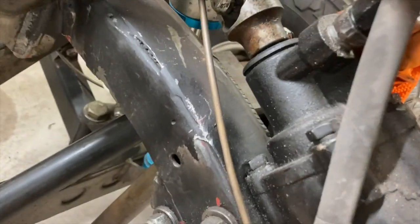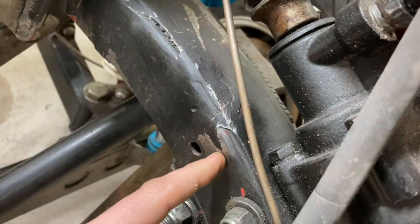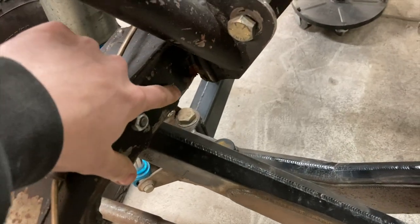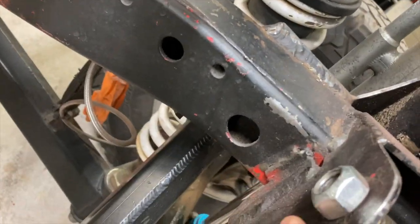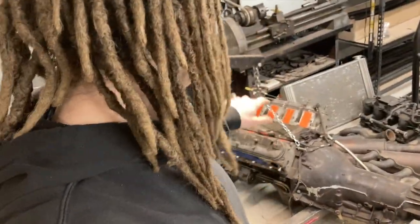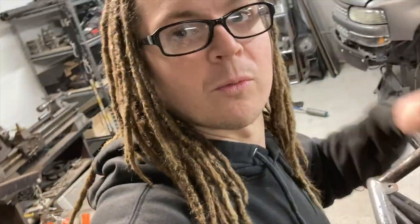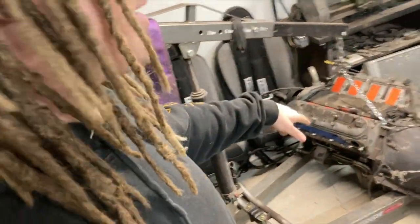From the steering, the beams, the forces, this box is starting to crack this frame right here. It cracks up there and runs down in here. This other side also has a crack by the motor mount. And this motor mount, the whole weld is cracked on the whole back side. So good thing I pulled that out and found that stuff. I'll get that welded up while I have it out.